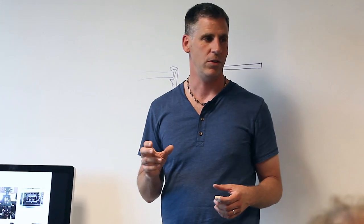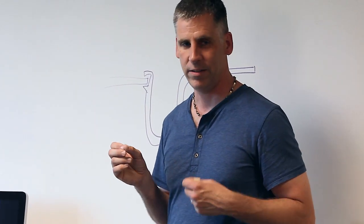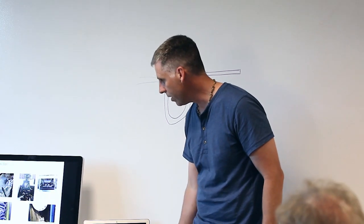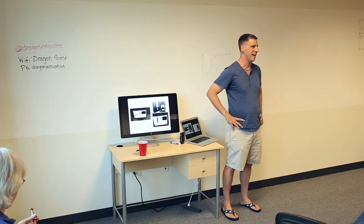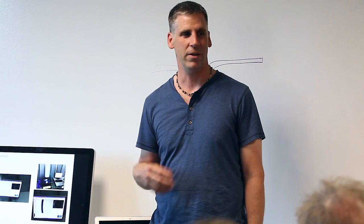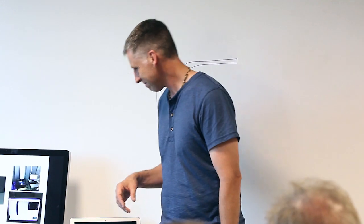So usually when you do die casting, you can count on some sort of post-processing, which adds, again, time and money, whereas often injection molding is just ready to go right off the bat. Post-machining die cast is painful. Yes. And so there's definitely a plus and a minus to die casting. In general, if you can get by with injection molding, that's often a much better way to go. It's cheaper, it's faster, and there's less hateful post-machining.